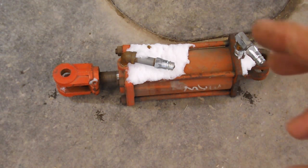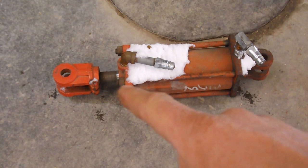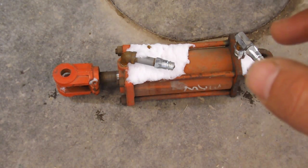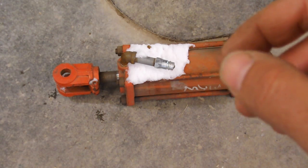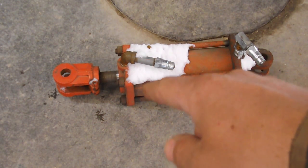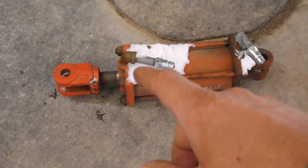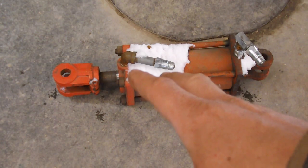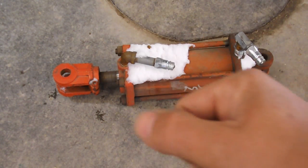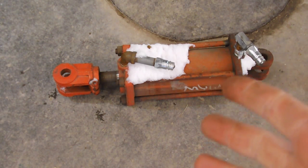What I originally was going to do on my big cylinder was get different rods, make them a little longer and put more thread out there. But literally, in the middle of the night, I sat up in bed and said, 'I have a better way of doing this.' Instead of getting longer rods, I want to make my own nuts. I thought about just getting those coupling nuts for a ready rod, but they don't make them in fine thread — at least nothing available locally to me.